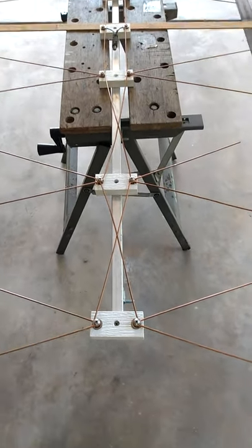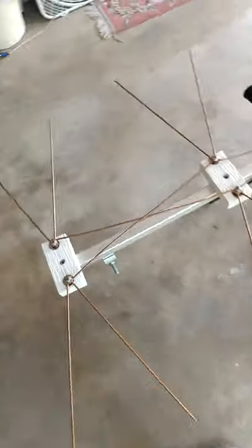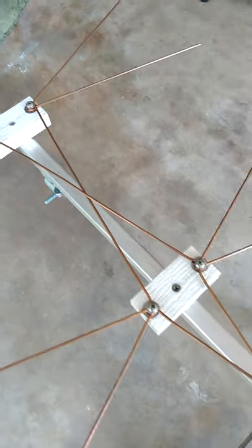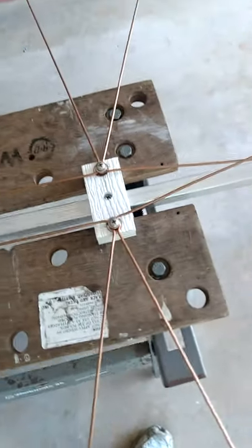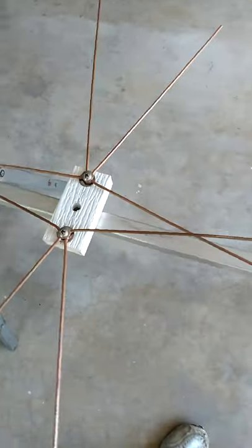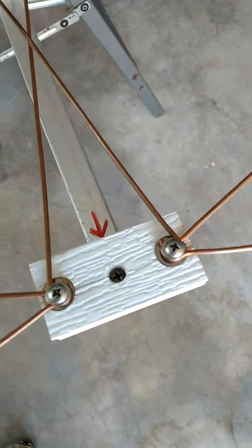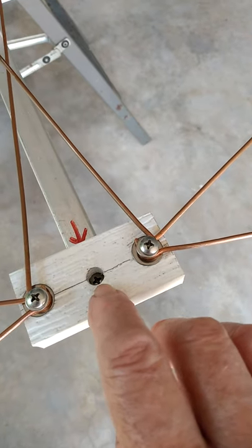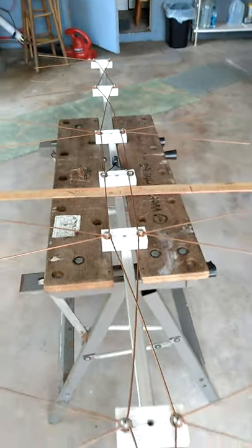Measurements for the FF6. The backbone on this antenna is 61 inches overall. The working area of the antenna is 60 inches. I added an extra inch so I have a place to bolt my first and my last insulator down.